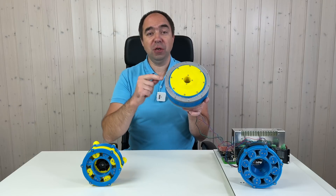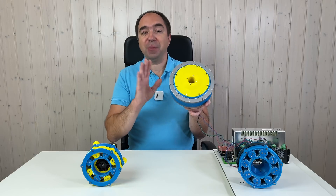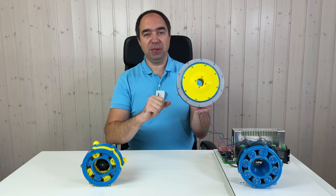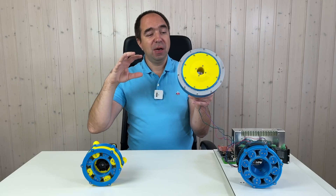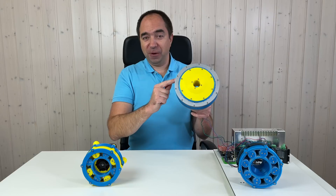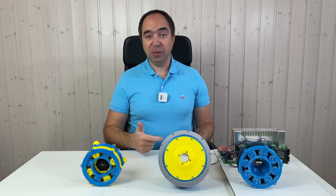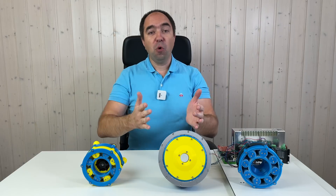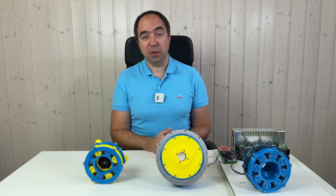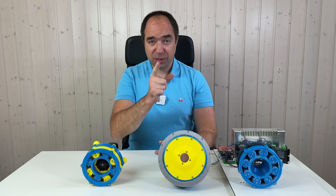I think the new design is going to be more solid because of the two additional cross roller bearings — it's bigger, yes, but for the robot arm it's going to work. I plan to design a smaller version and an intermediate version, so with three versions I'll be able to make the robot arm. I would like to make some small modifications to eliminate most of the dowel pins. The CAD files and STL files will be available for my patrons for 10 dollars per month. The more likes and subscribers this video gets, the more videos I'll produce.